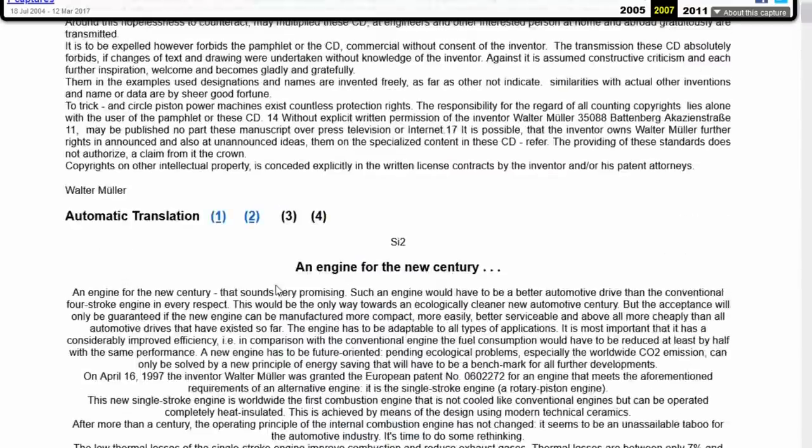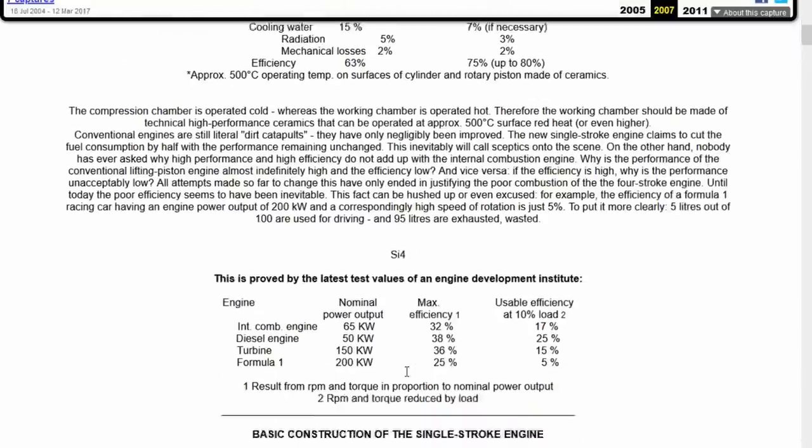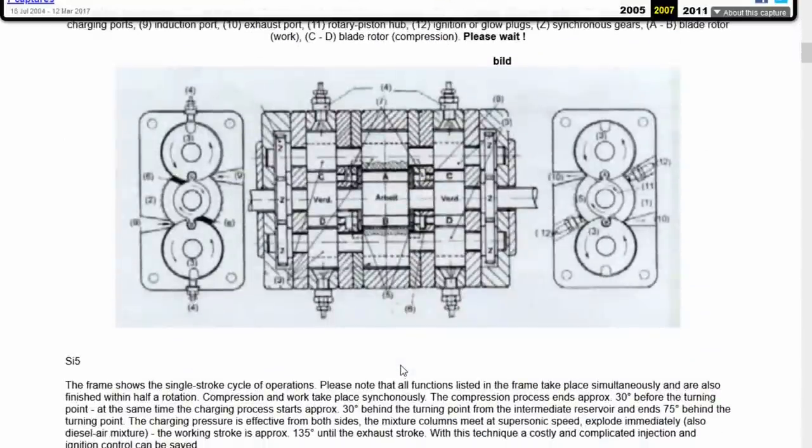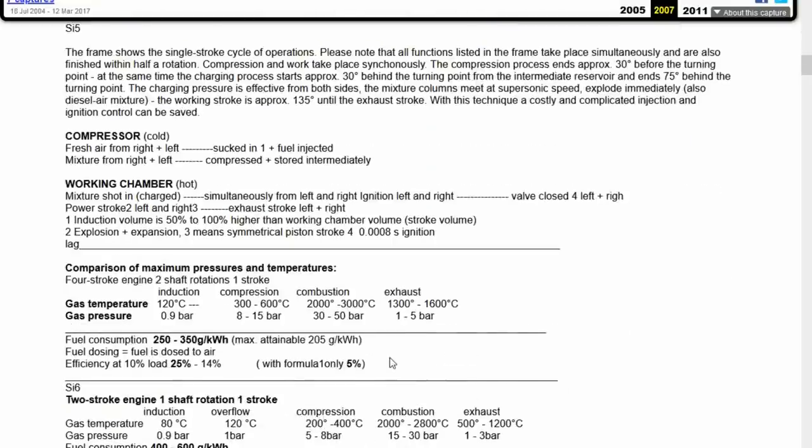So like I say, when you run through this, there's quite a few things that don't make thermodynamic sense. This is completely rubbish, because the maximum you can usually get out of an engine is about 75. That's the possible maximum with no friction losses, no pumping losses, just nigh on. Like, it's perfect, basically. It's a perfect engine. You're not getting 80. Dream on. It's just not going to happen. And people might say intercoolers and stuff. That all requires work. It's just not going to happen.